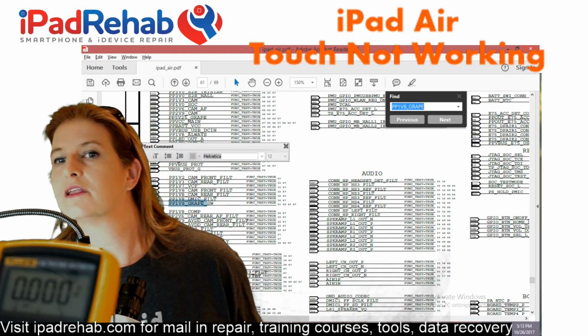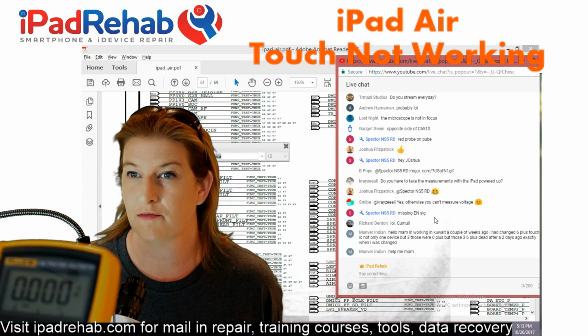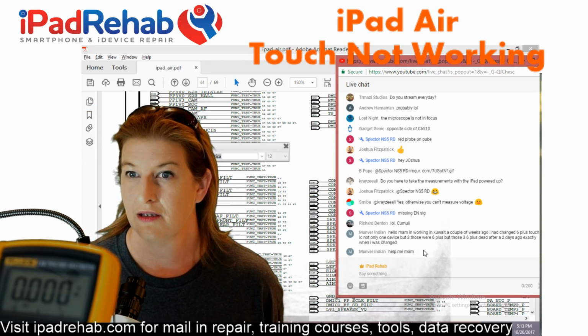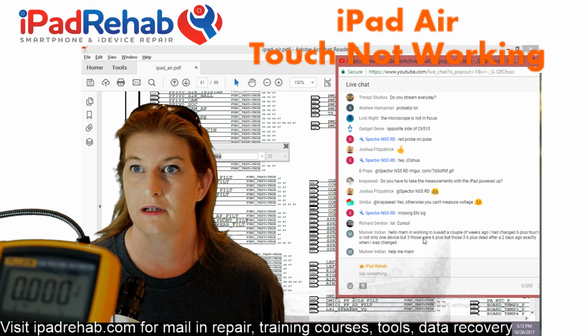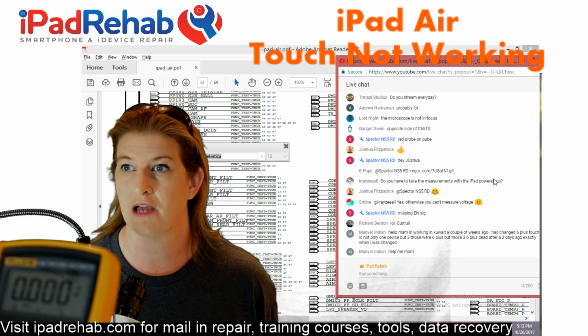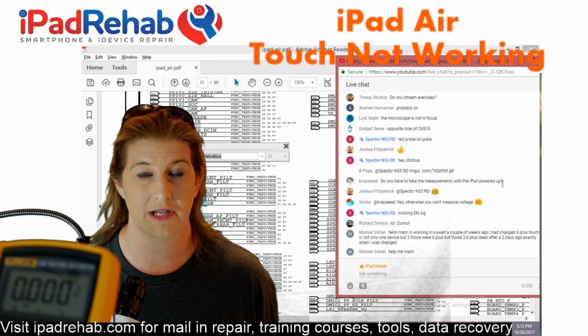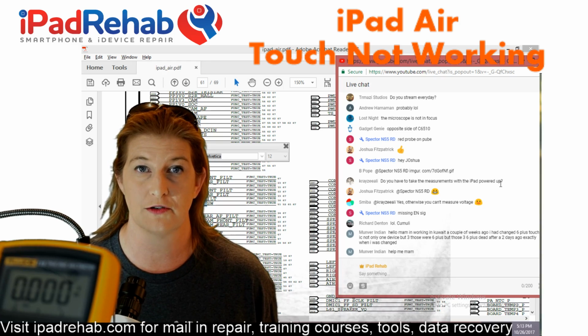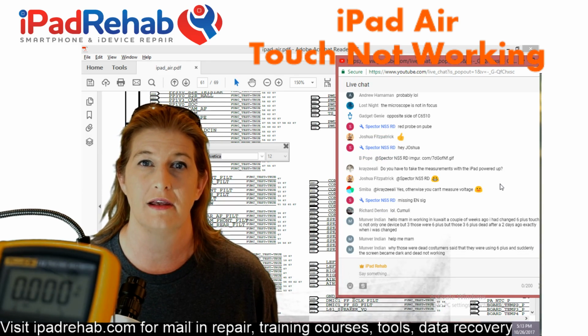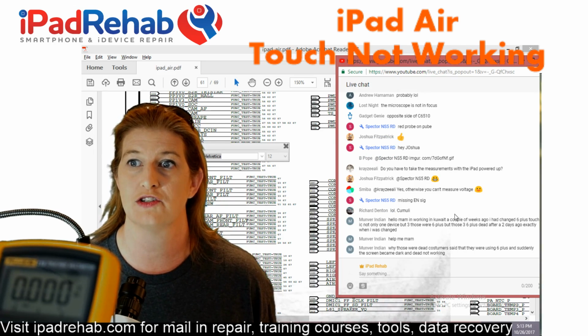Let me click to make sure that you guys can still see what we're talking about. It's missing the enable signal. Okay. So do you have to take the measurements with the iPad powered up? You tell me. Can I expect these voltages for touch to be present if the iPad is not powered up? Think about that and see if you can answer that question.